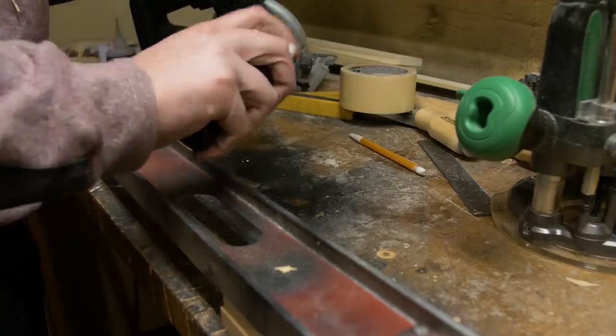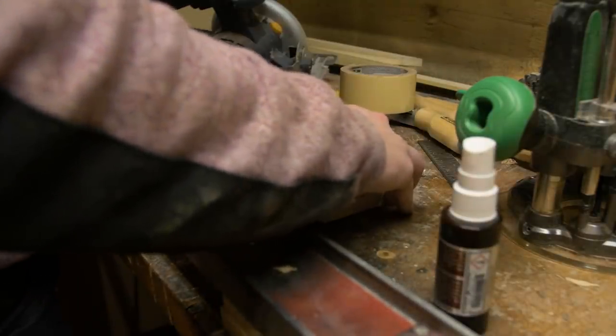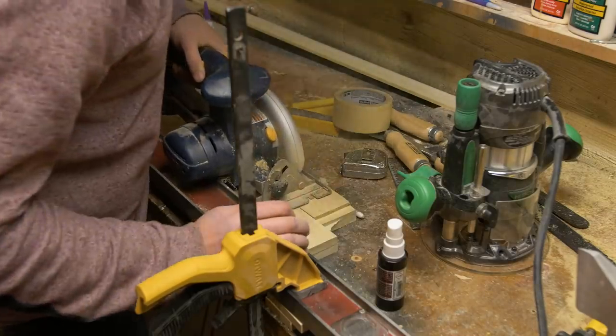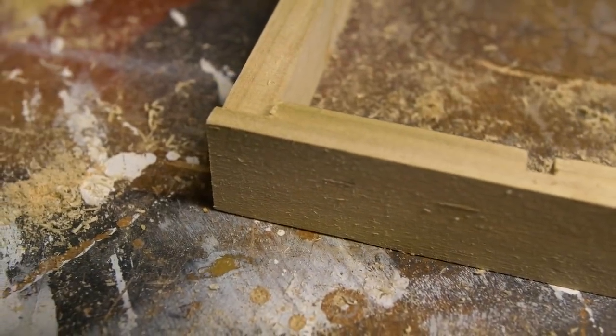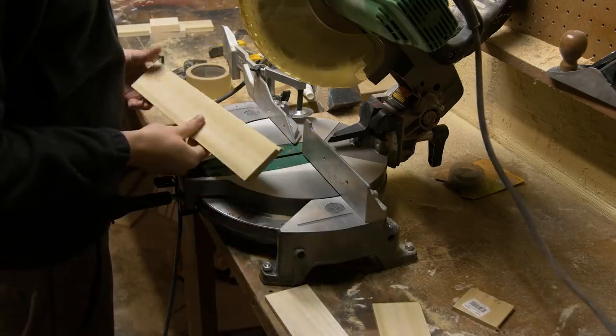I glued the two pieces of wood together to hopefully have the best chance of a consistent rip across all the wood in my case, so I cut them at the same time. I made the cut and the glue tape trick worked great, but guess what, guys? I didn't perfectly line up my fence, so my cut wasn't straight, and now all my corners are messed up. I figured I could fix this with a hand plane later, so I moved on to cutting the dividers.